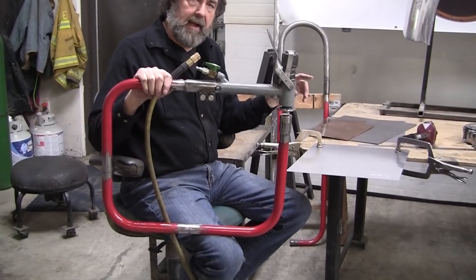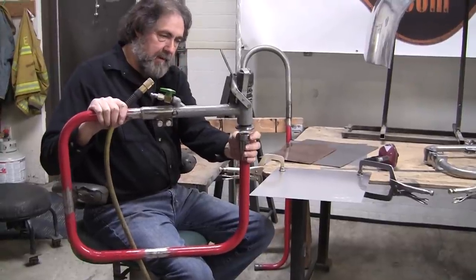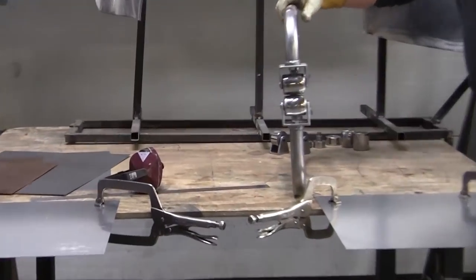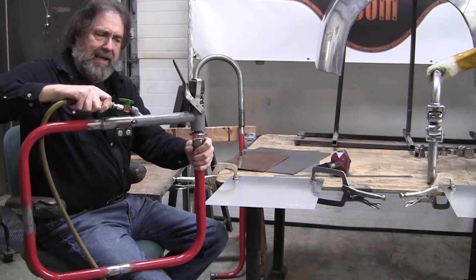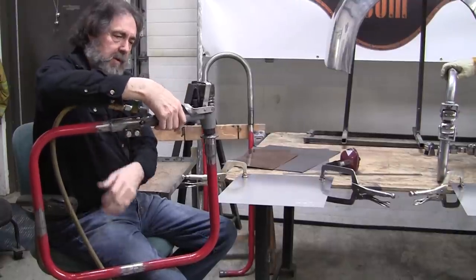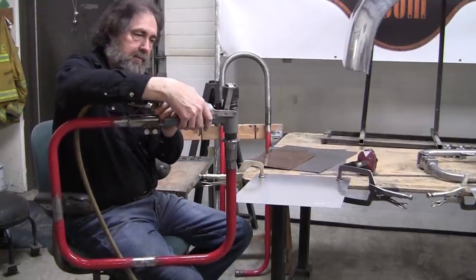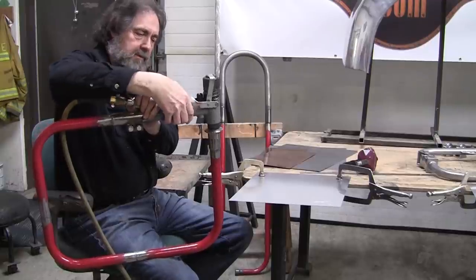The air hammer is an intermittent tool — you get intermittent contact. The English wheel is constant contact; once the wheels come together they're always in contact with one another. I have a die here that has a little bit of crown to it. This probably has a little bit more crown than I have on the anvil on the English wheel, so this might actually work a little faster. It has an air control valve that shuts the air supply off, controls the squeeze amount, and also has a throttle. This is a Chicago Pneumatic — I think these came out in the late 40s and they probably made them into the 60s. Really loud, so I have to wear muffs with it.